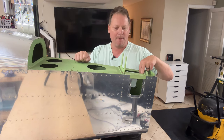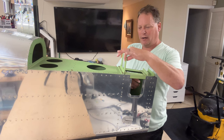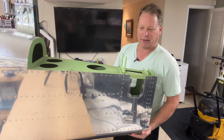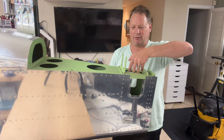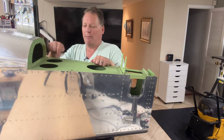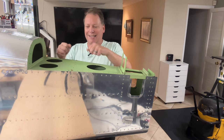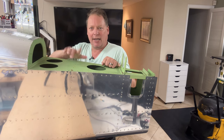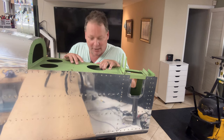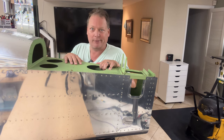I know there were those little braces in there — I'll deal with that. From the back, I intend to pull out all of the rivets that hold these bars in, the bolts as well. I'm pretty sure I'll have to take this rear skin off, which sucks because that was really hard to put in. But I should be able to twist this bulkhead to get it out, which gives me better access through the rear to take out number 10. Where I might have trouble is the stiffeners in the bottom and sides — I don't know how well I can turn this thing in those J channels. I'm going to video it as best I can, and hopefully I'll publish something useful for other builders in the same boat.